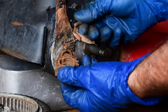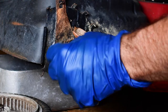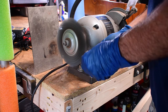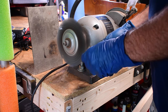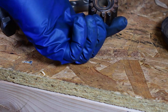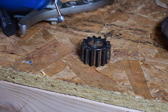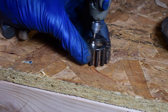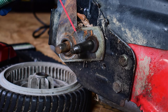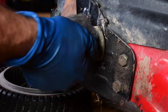I'm just going to clean this up with a wire wheel, and I'm going to clean this up with some steel wool, and then I'm going to put it back together. The bench grinder wire wheel cleaned this up pretty good, but I couldn't quite get inside of here, so I'm just going to use a Dremel to finish that off and get it nice and clean in there. To finish this up I'm going to use a little brake cleaner, and I'm going to use the steel wool where I couldn't hardly get the wheel off.